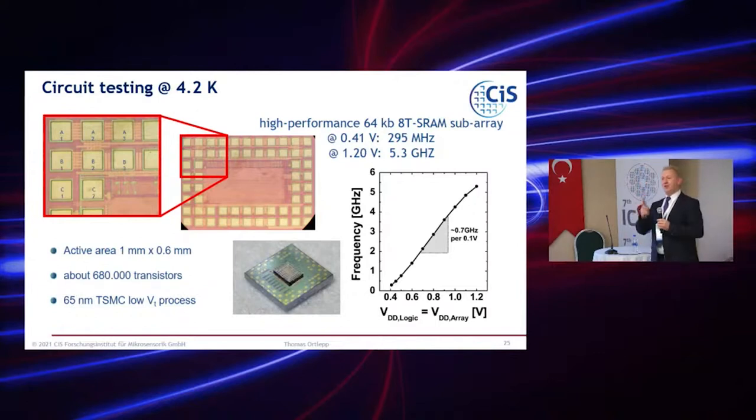The problem is flip chip bonding only works once. If you have 3 chips, then how to bring the 3rd chip to that? So we also need interposers for the integration and the optical fiber connection through holes. And how this all looks together, I will show maybe at the next conference.